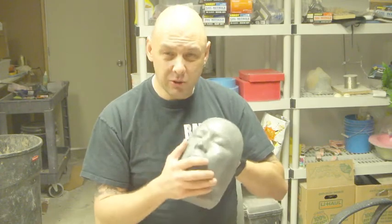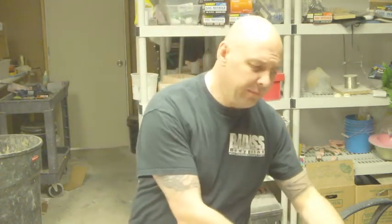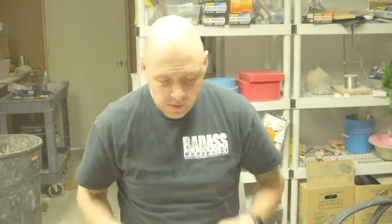1630 is what's called a filled urethane. So it's a urethane. What is urethane, you're probably asking. It's a synthetic compound, and it can be either a rubber or a plastic or a variety of different things. But this particular product has fillers in it, like metal powders that make it really good for foam latex molds.